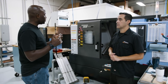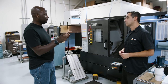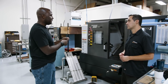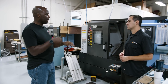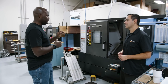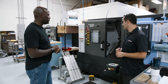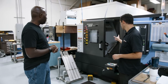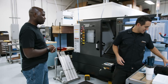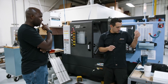Basically I want to get to the point where — you know I have two sides of a pin, you gotta machine this side and machine this side, it's basically two ops. The idea was to put it in one side, do your thing, put it in the other side, do your thing, and then a robot grabs it, pulls it out, puts it in the bin. Then it just pulls stock through and does the whole thing over again. This sub-spindle does the first op, pulls it, parts it off, then it comes down the back side and broaches it — so even the hex heads are broached.